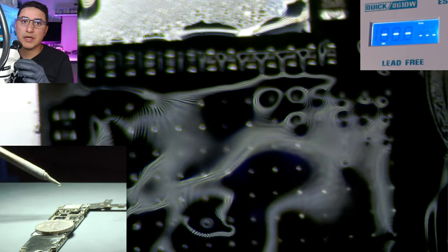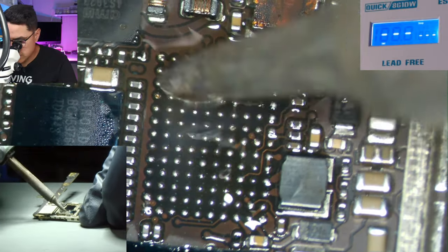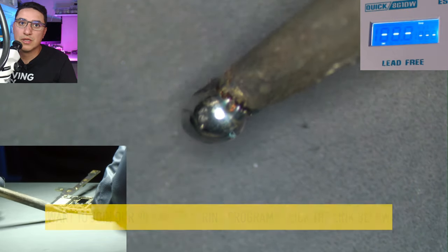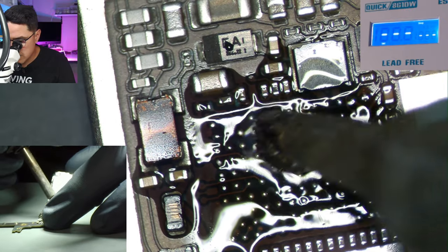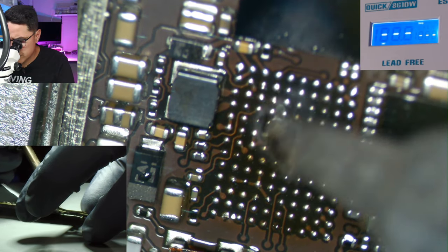The goal of this part is to run your iron over each pad to replace the solder that's already there. The key trick is to keep rotating the board so you're always at a good angle. You don't want to press down hard at all — you want the bubble of solder on the tip of the iron to do all the work. As this bubble of solder goes over the pads, it essentially sucks up the solder on the board and replaces it with your solder.